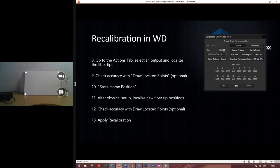This is when, for example, the black pixel is too bright or the white is too dark, then you don't have a difference between them, so you wouldn't get correct signals to recalibrate it. That might be a reason why it's not working, or there might also be too much side light on the screen that erases the black.